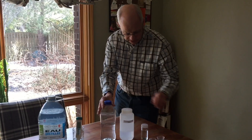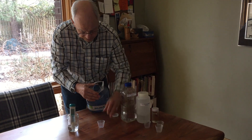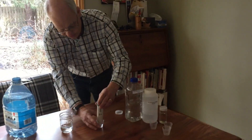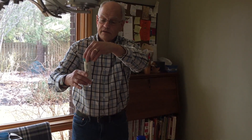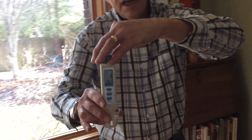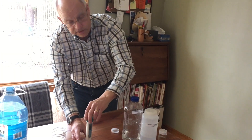So how would you go about checking your conductivity meter? The first thing I would do is take a little sample cup and pour out a little bit of distilled water. Then I take my device that's been soaking, place it in, and turn it on. You just have to make sure the electrode is completely submerged in water, because if it's not it won't be working right. The device takes measurements for a few seconds, averages if the reading is changing — in this case the number is about two. So we're ready to measure a sample.